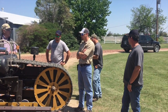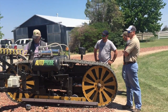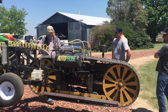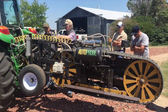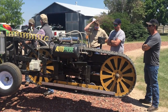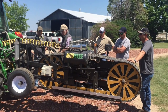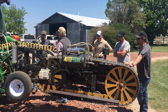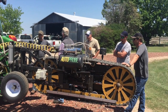How does it do on a turn? It does fine — that's a good question. If you'll notice, this is mounted on a bow here and sets the rollers front and back. It's on a three-point hitch, which if you turn and kick something around, you just follow it like it's on a trailer. It's kind of like it's on a pivot. This is a good drawbar — it swings. This whole frame swings quite a bit. So if you turn, it just follows you around.